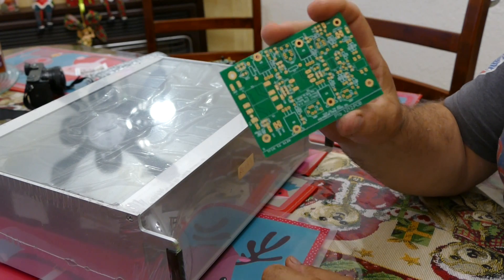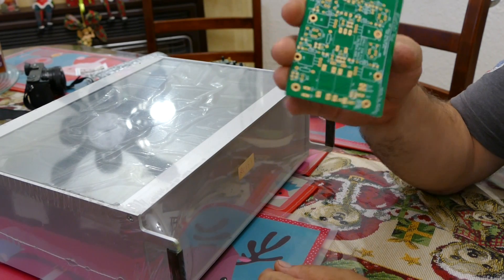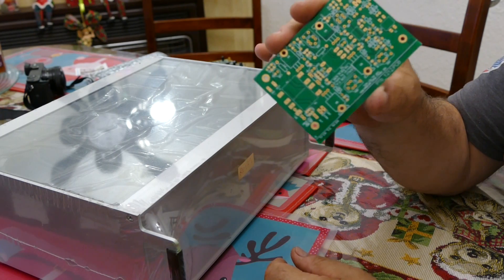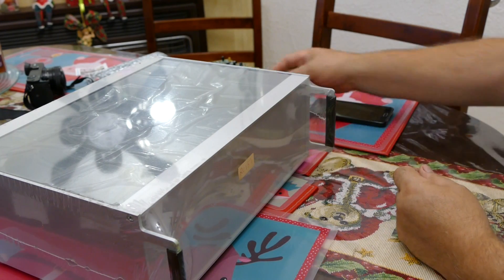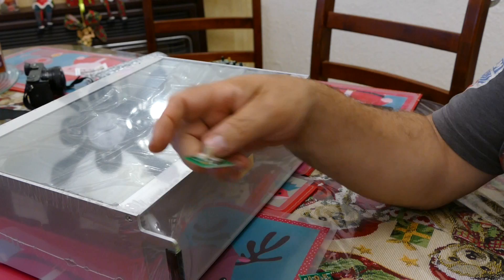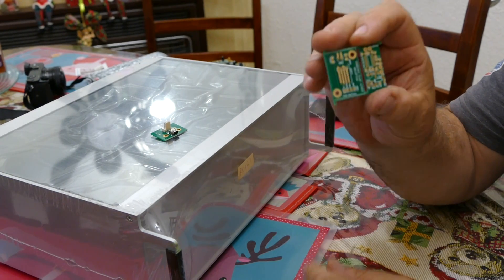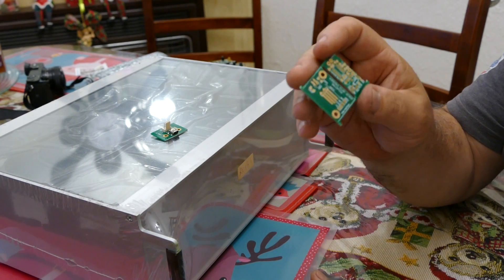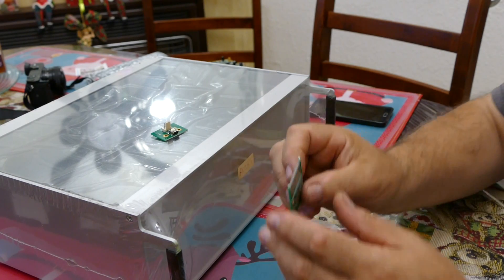There's a circuit board for a 20-watt power amplifier which I haven't built yet. Basically the transceiver outputs low power, this board brings it up to 20 watts, and then that board drives the 150-watt board giving 150 watts of total power across the whole HF spectrum. There's also a little micro USB board for an external micro USB on the back, a board for an optical encoder for the tuning VFO — though I don't need that particular board because I've got a commercial optical encoder — and a little buzzer board which I don't really need, but handy to have.